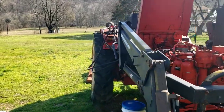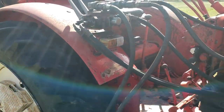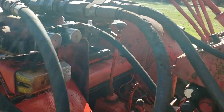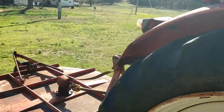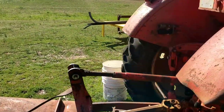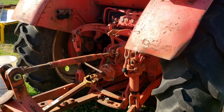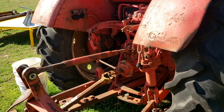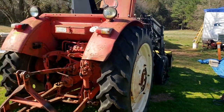The rear end is two wheel drive — this is not a four wheel drive tractor. The transmission has 11 forward gears and 8 reverse. The PTO is independent, with an RPM of 540 — that's rotations per minute. The tested horsepower is 50.7, so it's not far off what that engine's putting out.